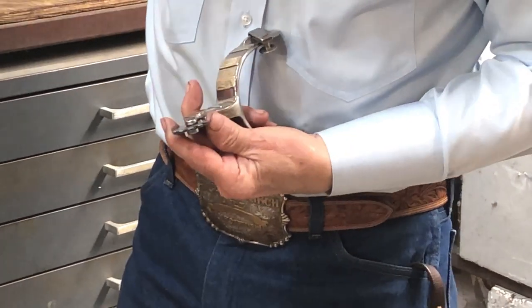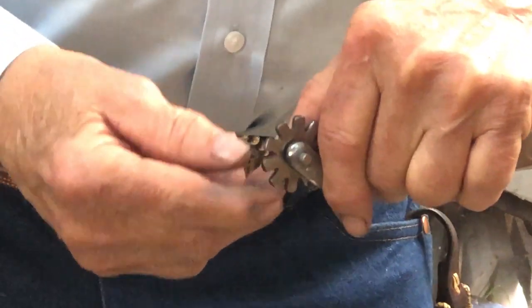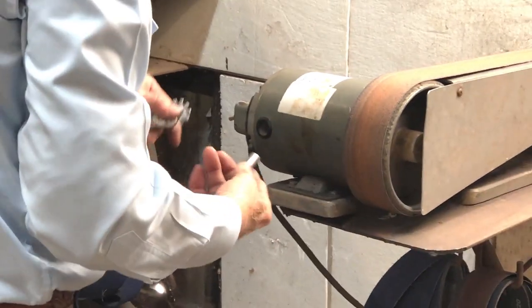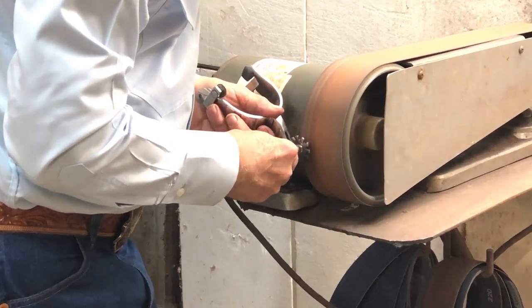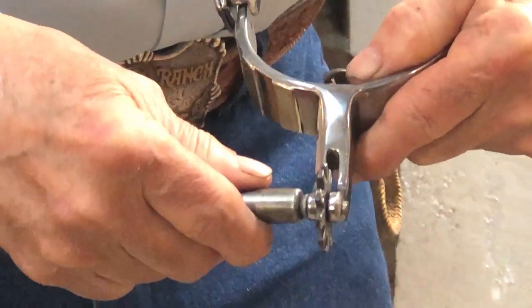From the outside, put the rivet through the hole. As you see it sticks out not quite a quarter of an inch, but I'm going to take a little bit of that off — you can do it with a file. If I take a little off I don't have so much material when I rivet it down. That's about what I've got left to rivet.